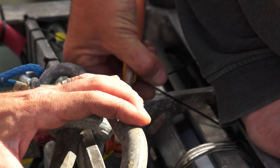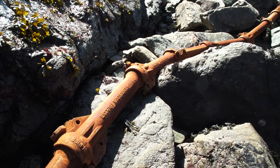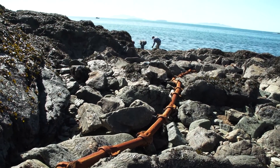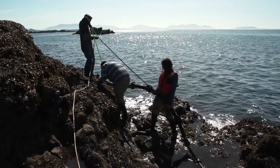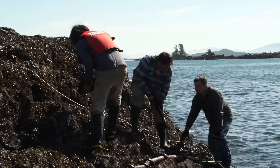We also need to prepare the cable a little bit for this environment. There's a bunch of metal pipe on the shoreline which is going to protect it through most of the surf zone. But we've done a small ROV survey and discovered that there's some fairly unfriendly terrain even below the surface there in the shallows, even at low tide. So we're going to prepare the cable with some more protection and also weigh it down with sections of chain.